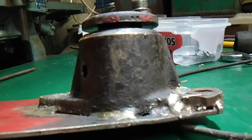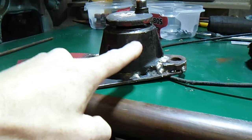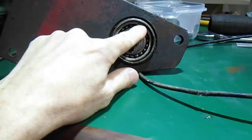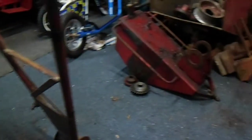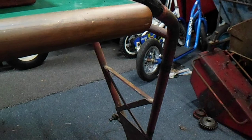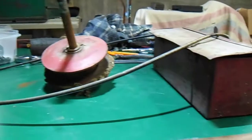I've got to grind away and get that down to a size that I can get back out of the shaft, and then I'll probably end up getting the whole section that runs all the way through machined — machine up a whole new piece that'll come all the way through to the bottom with the slot cut in it. So that's where I'm at. I'm just going to get the little grinder out and have a go at that now, and then once I've got a bit more time I'll get more carried away with some more of this cleaning.